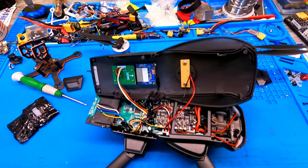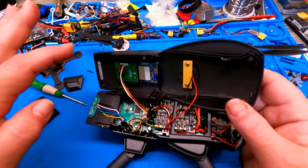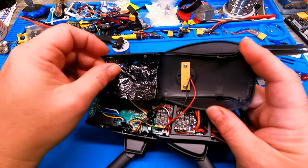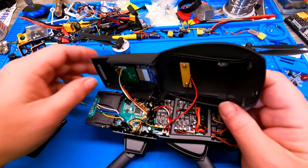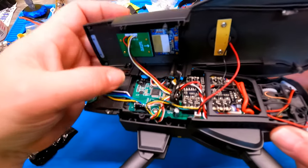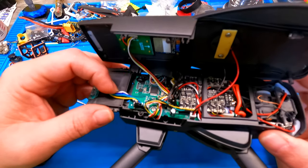Not sure. But I'm definitely going to try to figure this thing out, and I'm going to barrier both these pieces. I'm going to put a screw in this, then put this tape like this and barrier both of it, and I may even get some more barrier tape and try to make it better. So when this is close together like this, this module was more or less laying right on top of this board here. You can see where they pinched wires here. So they threw this thing together is what happened.